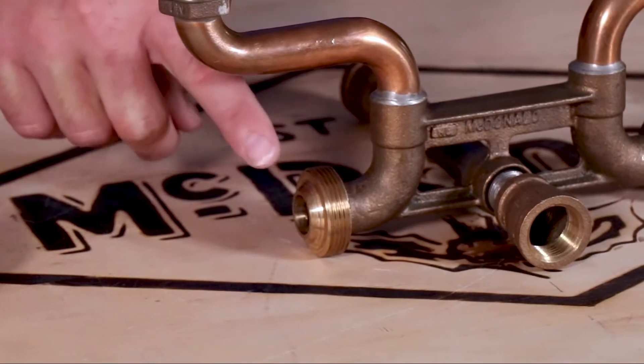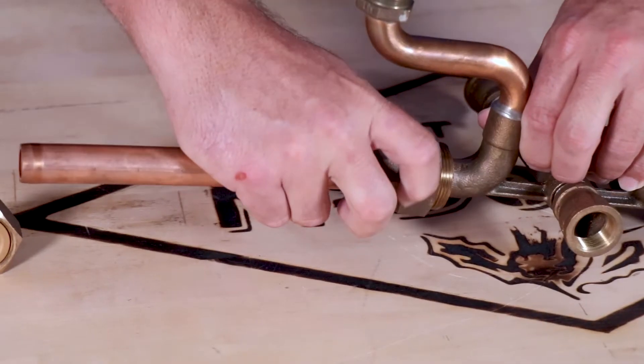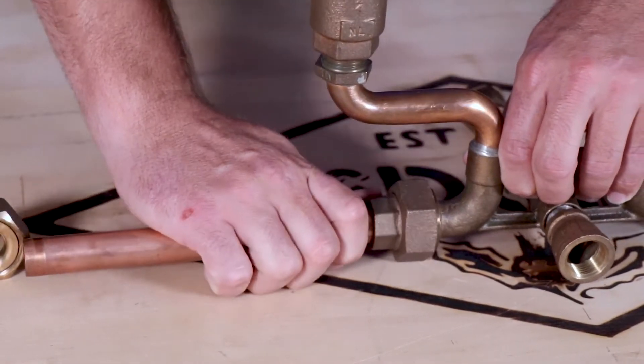Or two, the bottom bar of the setter has a bull nose that can be used with flared copper. The FNPT adapter can be inserted onto the copper tubing. The tubing can then be flared, tightened, and sealed together.